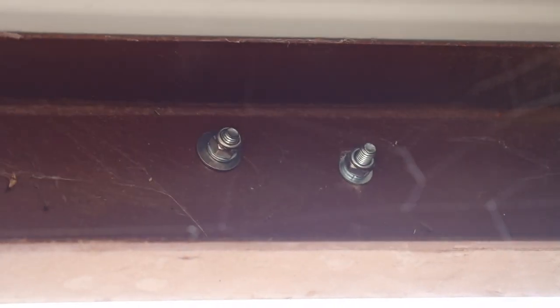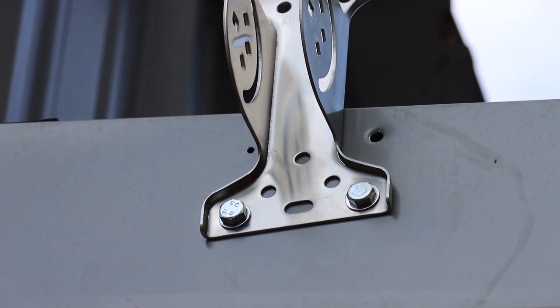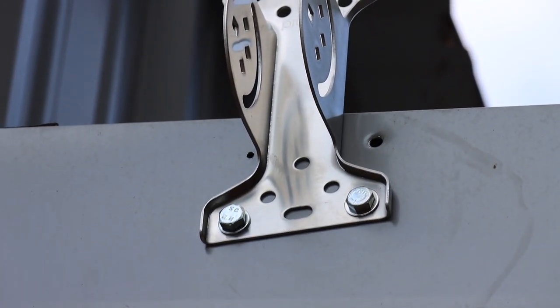Let me show you what we did on the back side where the red iron is. We put two bolts in instead of screws — I should have brought my Bosch cobalt bits but forgot them. We drilled through the red iron and through the outer metal. I made a mistake though — the red iron, which is what's actually going to hold on to something, was a little bit lower than I thought. I ended up drilling two holes that were just through the outer sheet metal and had to re-drill a little bit lower to go through the red iron beams. But the bracket is now solid, so we're going to put up our pole.